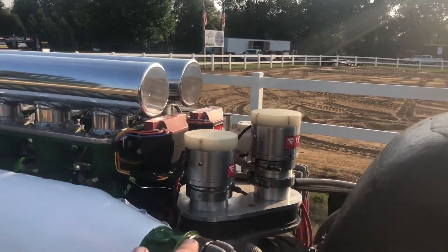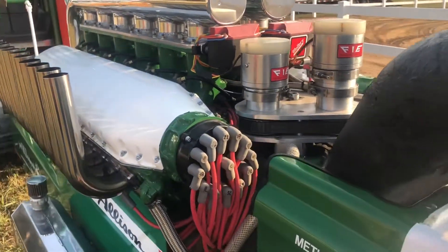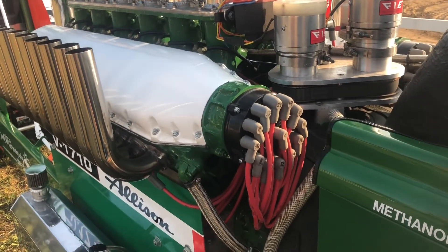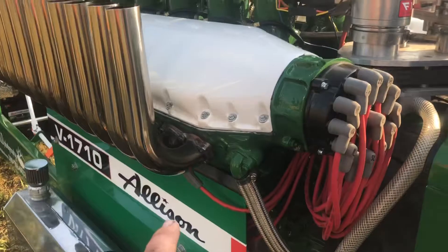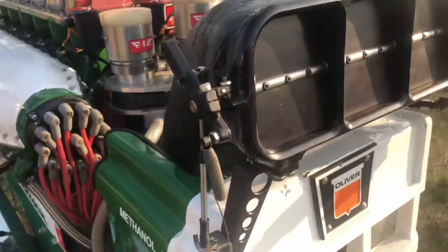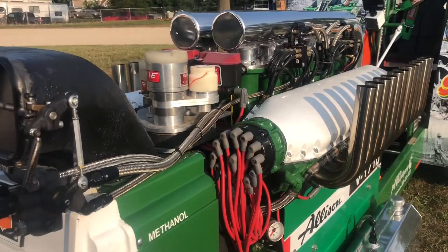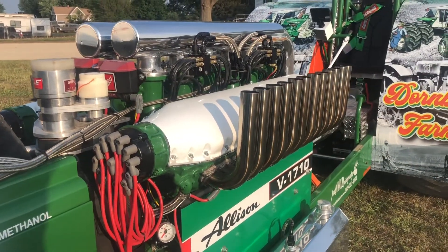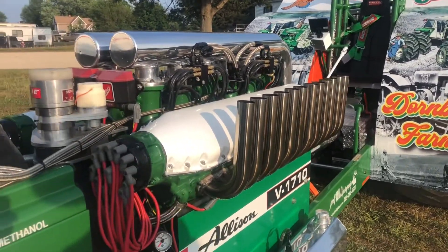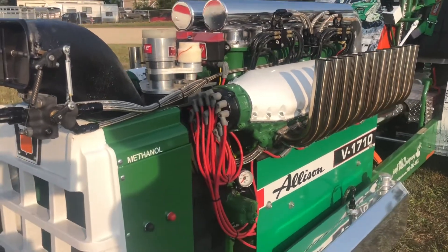Here's your magnetos. Because if anyone knows anything about these Allisons, there are 3,000 spark plugs. So doing a spark plug change on this — there's spark plugs out here, you run down here and up here, then you've got two rows inside, then you've got one on the other side. The ones on the outside are simple — those are easy to change. But the ones on the inside are the headache. Is that every run you've got to pull those out and check them? If it runs good, usually we leave them. Probably every three runs we'll pull them out, make sure they still look good, and if we need to change one, we'll swap it over. So far we haven't had to do any major repairs through that side of things.